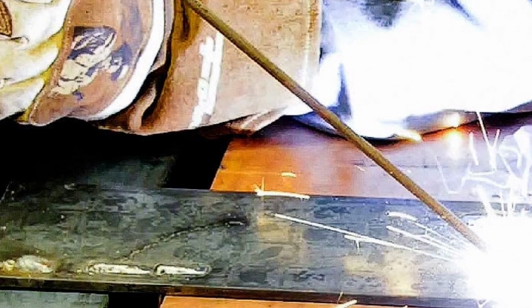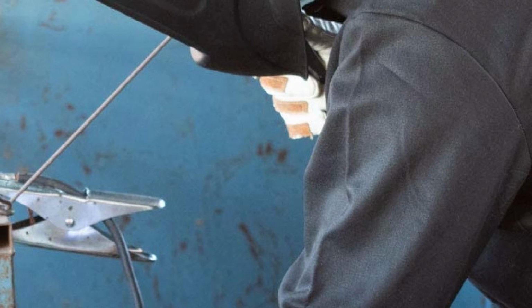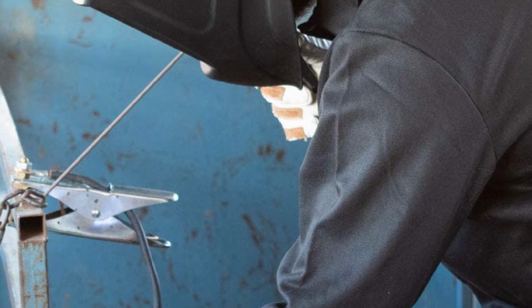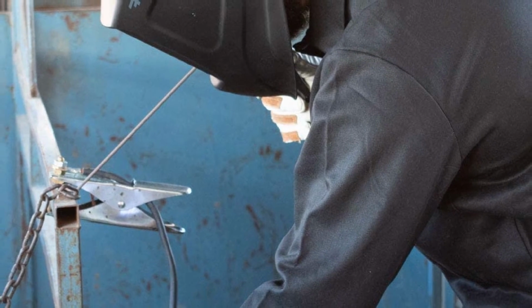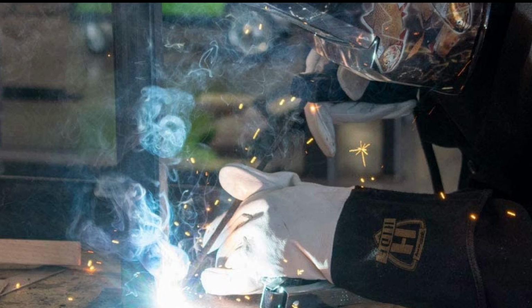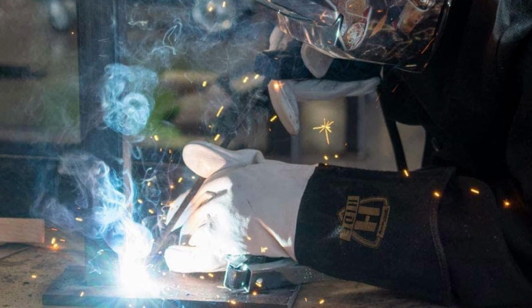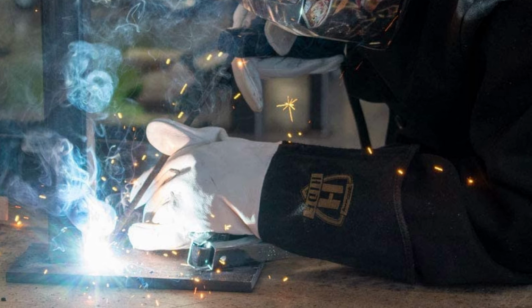It supports different types of welding applications, i.e., light fabrication, worn-out steel surfaces, and ship repairing. It can be applied in various kinds of steel products like low alloy, mild steel, and galvanized steel. The electrodes of Forney 30305 E6013 use AC and DC currents, so it's suitable for welding machines with different voltages.